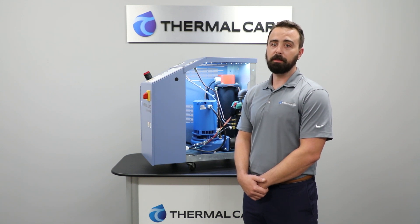These units can also be used in a variety of different applications, including sterilizing processes or even controlling chemical reactions. The RQE series is available with a 9 kilowatt all the way up to a 48 kilowatt heater, and the pumps are available from 3/4 horsepower all the way up to 10 horsepower. This gives us the ability to customize the unit to exactly match the demands of the system.